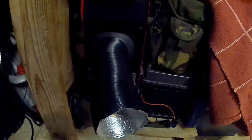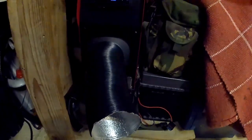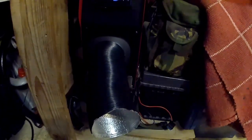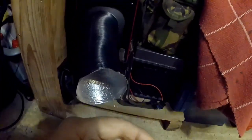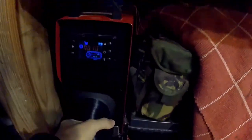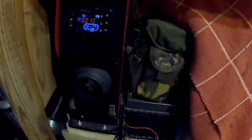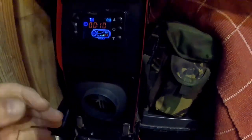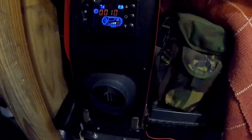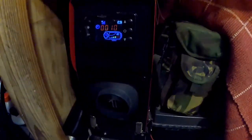The fuel pump has now gone off and it's just got the glow plug heater inside. It'll keep going like this until all the hot air is blown out. I'll take that off now. The fan is coming up because it's cooling down. You have to let it do this until it's completely off, and it normally clicks when it goes off.